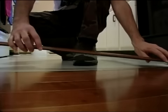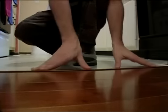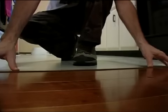The floor can handle light foot traffic 12 hours after installation, but the tape should remain in place for a full 24 hours. There are matching trim pieces available for the ends of the floor that butt up against carpet or any other flooring type. To finish the edges around the room, use a piece of quarter round as a trim piece.